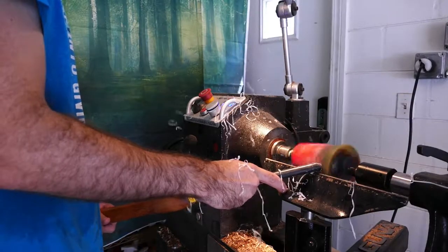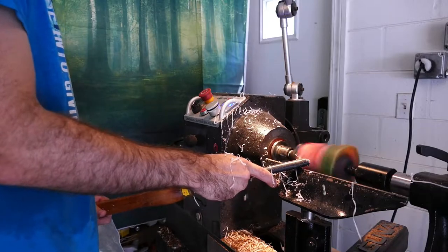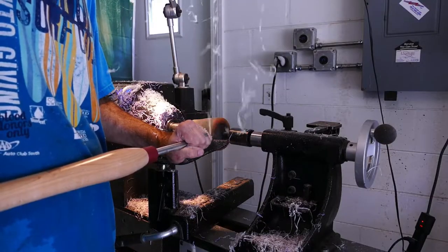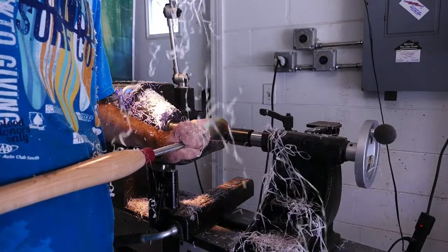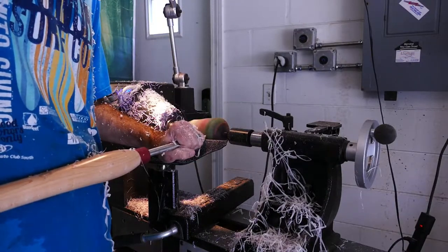Alumilite claims that turning the resin is as easy as could be, but I find it pretty tricky. I do have a scraper with a negative rake profile, but it's hard to sharpen and maintain. So I use my bowl gouge here for a while, but then I switch to a carbide tool as progress is slow. Pine is not a good wood to turn. It's really hard on tools. The fact that it's been stabilized can't help much either.